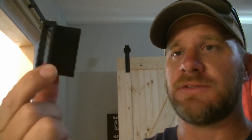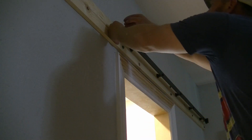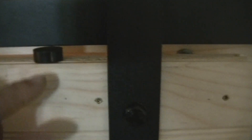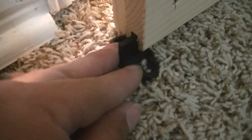The track is up — I just need to install the stoppers. They have two set screws and come with an Allen wrench. You slide them on from the appropriate direction and position them trial-and-error to where you want the door to open and close fully. The kit also comes with little anti-jump protectors that secure to the top of your barn door so it doesn't jump the track — they fit right into that groove we left uncut. Scoot it down and it keeps the door from rocking back and forth. And that is a barn door right there — closes nice and easy, stays on track. If you enjoyed the video, give it a like and comment, and I'll see you on the next one.